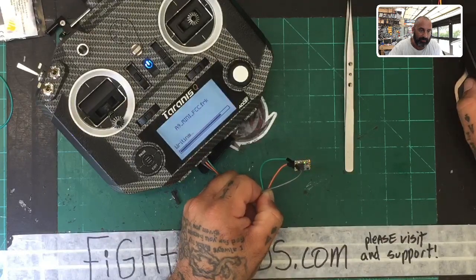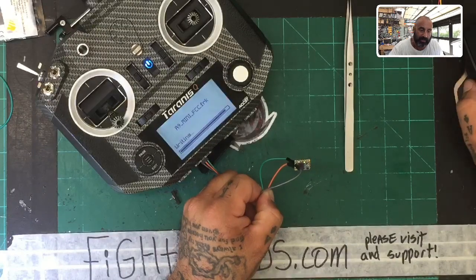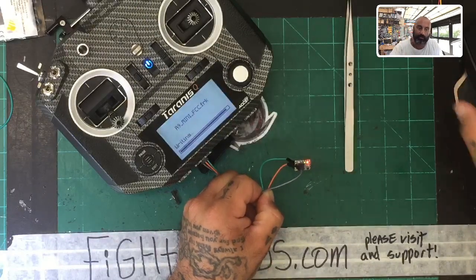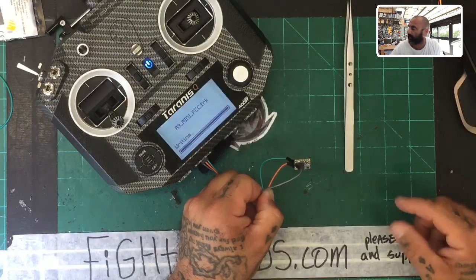And on this one, actually, my whole thing is different. This drawing, they ended up coming out different. But on this cable, the positive is on the outside, then it's ground, then it's signal, okay? So you have basically the positive and the ground switched. Again, it's $2, and it'll also have the same chart where the colors, if they change.